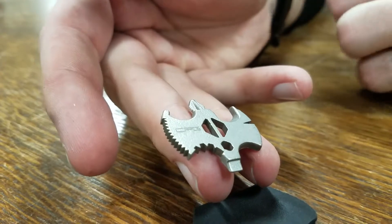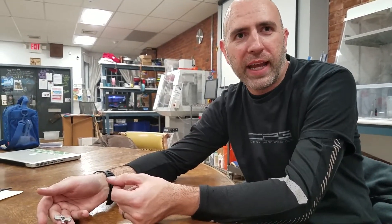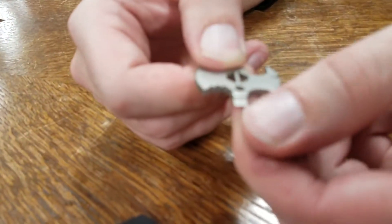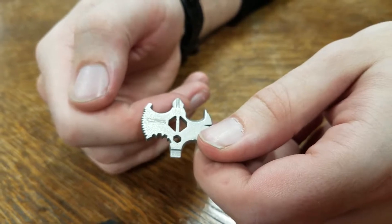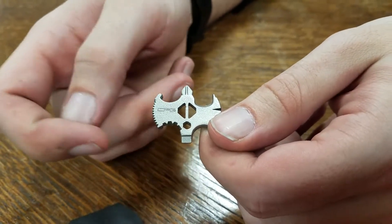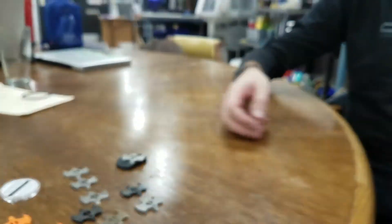For people that don't know, wire EDM — think of it as almost like a solid laser. It's a wire that's electrified, almost like a plasma wire, and it can cut through just about anything, including metal. It's very precise, and that was required for this. Then there are some secondary hand processes to grind out the screwdriver — Phillips head, modified Phillips, and flat — and the small cutting edge. Then laser etching. And sandblasting. So it's a full set — a lot of different steps.